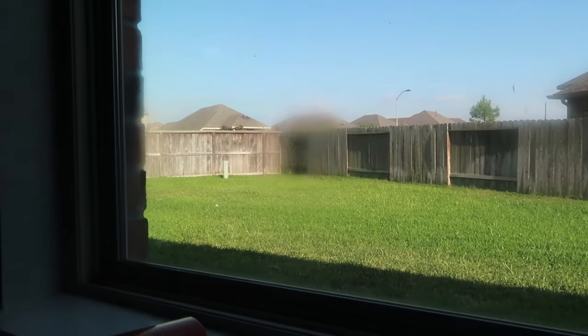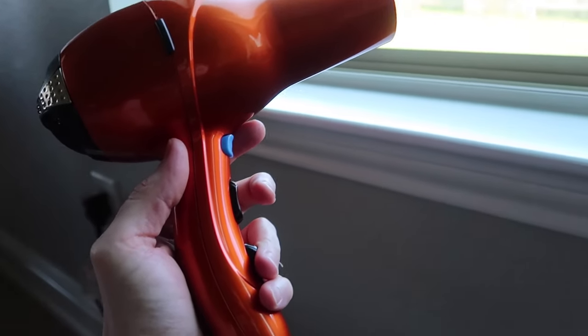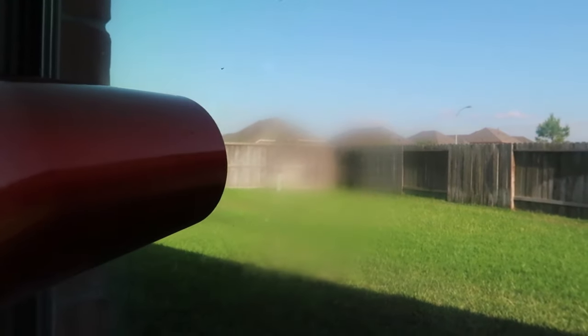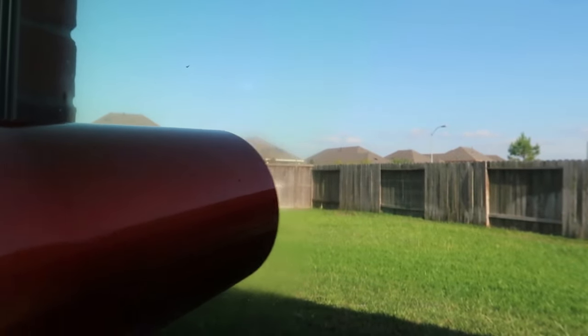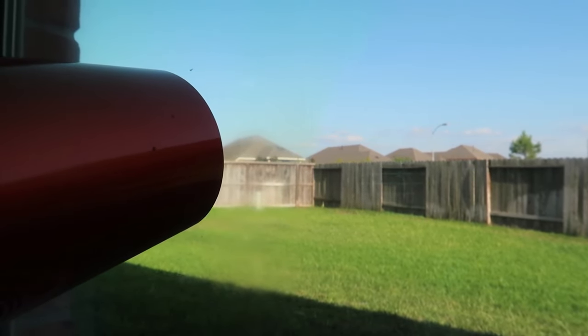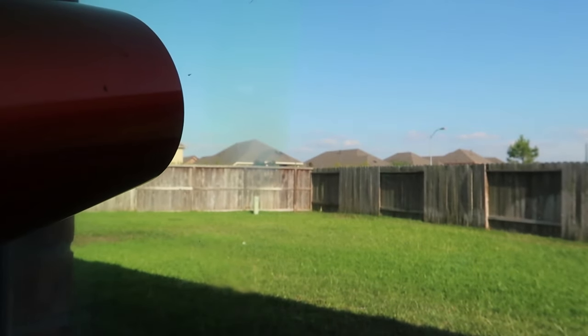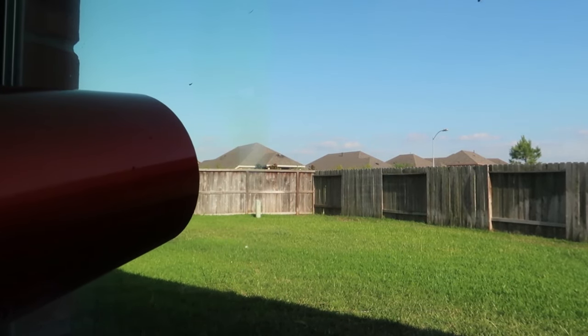Now that the source of the moisture is gone, grab a hair dryer and put it on full blast. Spend a lot of time patiently drying out the inside of the window — it's going to take a while, but your hair dryer should be able to clear it up. One thing to note is that when you dry out the water it's actually going to rise a little bit, so make sure you pay attention to the entire window. You may have to get on a ladder and go to the top of the window to make sure the entire interior is dry before you try to seal it. Just take your time and dry it out nice and slowly.